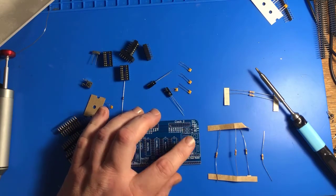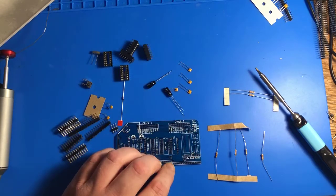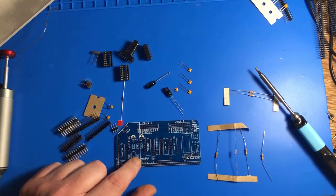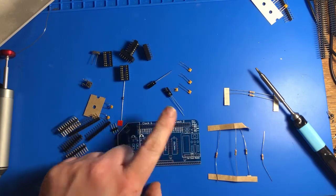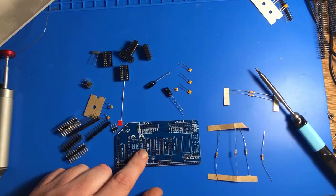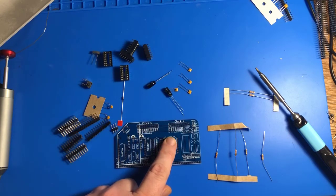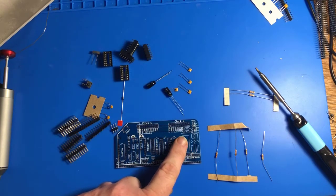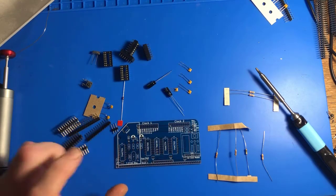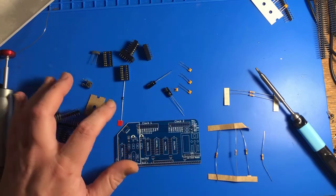You can still get the board made if you want to, but it's a little tiny board, so whatever. But I could plug in my clock module here to derive clock 2 from a separate clock. I have no real reason to do that, of course. This one clock can output to both these clock signals, and you can divide the clock signals. I guess that's what these resistors here are for. You can divide the clock signal from 7 to these fractions and get down to slower and slower clocks and do different things with them, drive different serial modules if you want, is one of the examples.